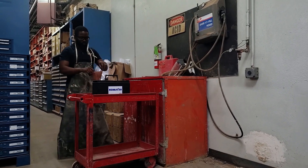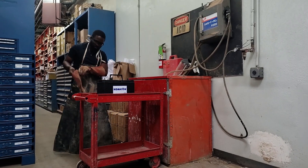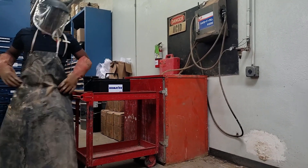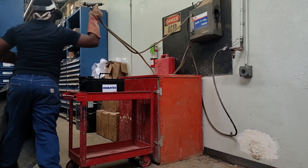Let's take a second to look at the battery filling process when done safely. Notice all trip hazards and clutter were removed from the work area. The employee wore the proper PPE including gloves, face shield, and apron. The spill kit is available and in place.